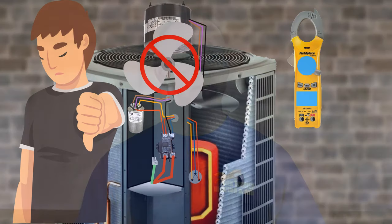I've gotten this call before. The customer says that the outdoor unit is making a very high-pitched noise, louder than they've ever heard before. When you get to the house and turn on the AC, you walk out to the outdoor unit and find that the compressor is pumping refrigerant, but the fan on top is not spinning. What's happening is the condenser fan blade isn't spinning, which normally removes the heat from the outdoor unit. If it doesn't, the compressor will overheat and shut down.